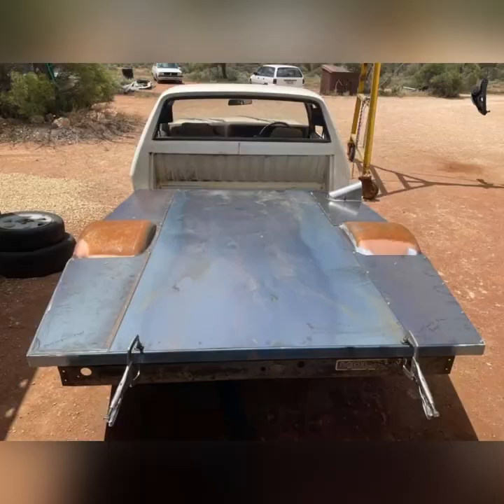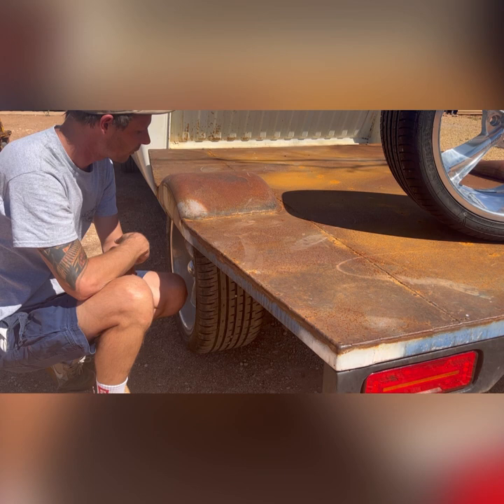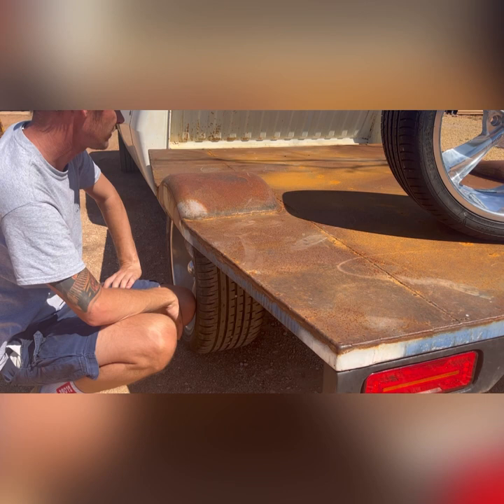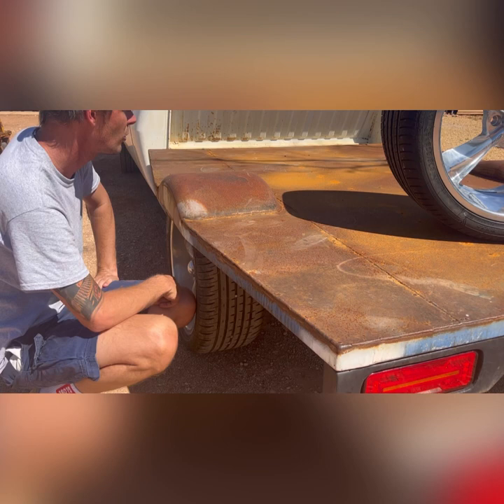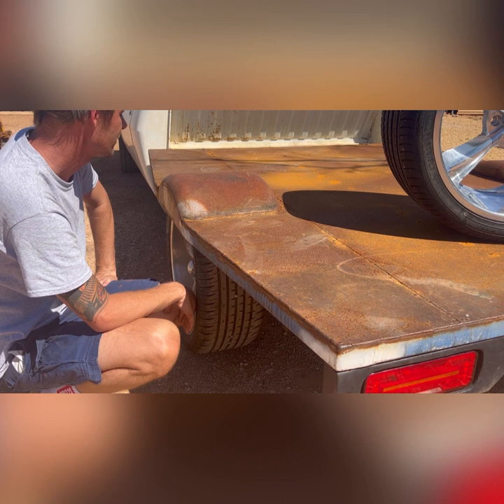The fundamentals of the tray: you can do your initial frame first, but when you want to go from the tire outwards you really need to have your wheels sorted, and know how low or high you want the car. If the tray is going to hug the wheels like these ones, you want it at the right height with the right size wheel, because you need those clearances spot on. You don't want to build a tray just to have to cut it up because it doesn't fit your wheels. Wheels early on — build your tray around your wheels, pretty much in a nutshell.